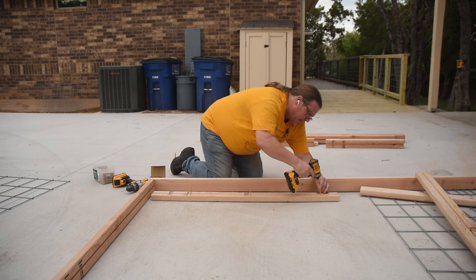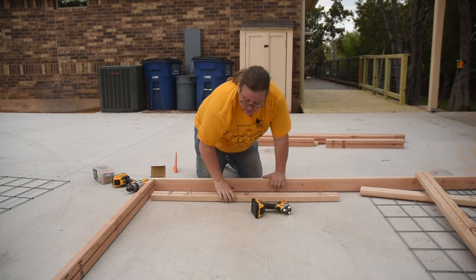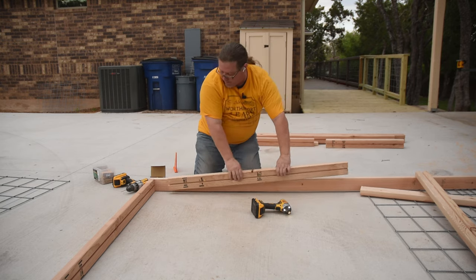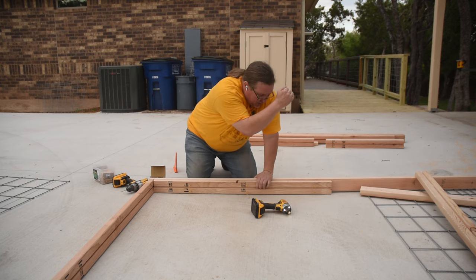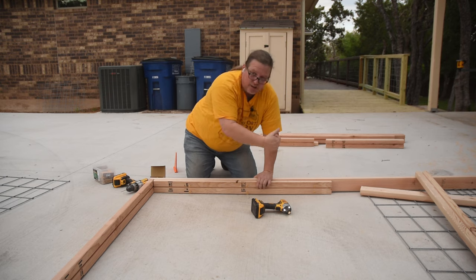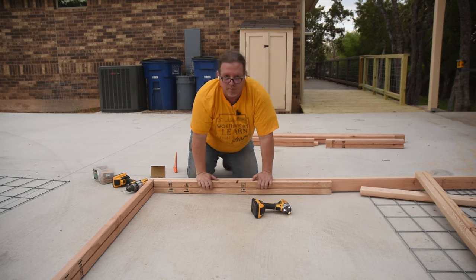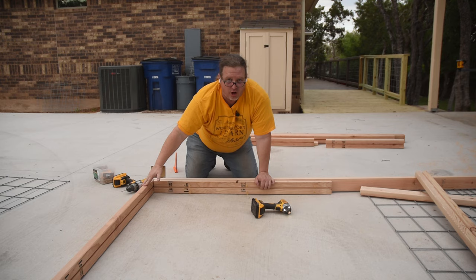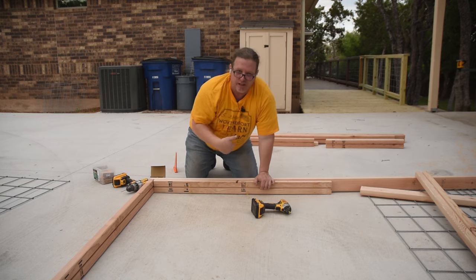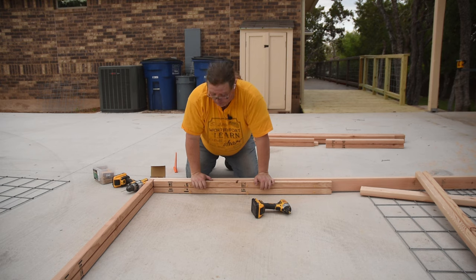From there, it couldn't be easier. I'm starting some screws into one of the vertical stretchers. And the idea is you just take that, you bump it up against the bottom. You slide in a fence. You put the next cross piece in. You slide in the fence. You put the top piece on. You just work your way up from the bottom. I foresee when I've got the posts in, I'll put all the bottom plates on, and then I can just go through and do each piece side by side. And since I'll be using a nail gun, then it'll go a lot quicker.